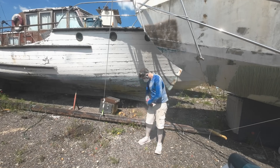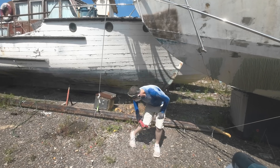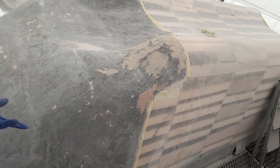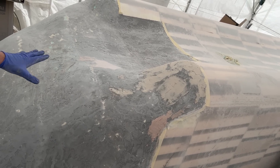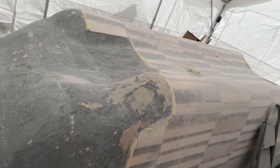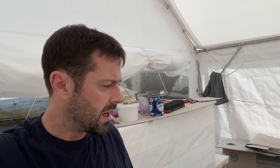Until I can climb inside a giant vacuum cleaner, I have to make do with the end of a broom. The next day, at the next filling stage — I'm pretty happy with how the main layer of polyester resin filler has gone on, with the thickener and anti-shrinkage filler in it. That's going to be much harder to sand. I've mostly ground it to roughly the right shape and now I'm going to use this much lighter, easy-sand filler which is already ready-made, to do most of the final shaping. Then we'll have the nose section done — that's the most complicated part of the mould.